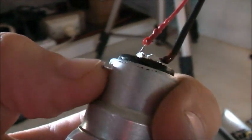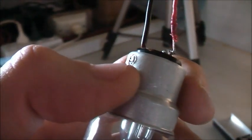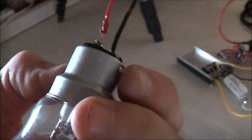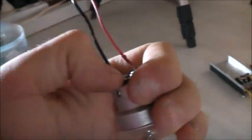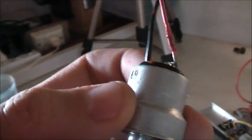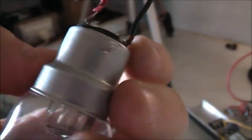I've got another two spare MOSFETs. I can see why this bloody bulb is so cheap — it turns out these pins aren't like the old ones. These are just moulded on and pressed on, actually just punched out of this shell. With an older one, they're actually a proper pin that's pushed in, glued in, and soldered in — a proper solid pin. But the ones in these, they're just punched out. Very cheap.